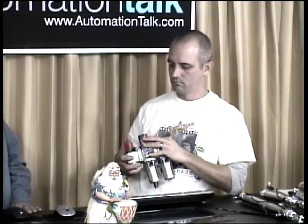Right. And then also, practice lockout, tagout. And then one step further, even if you shut off the main valve and lock it out and take pressure off the system, there's always going to be some accumulation of pressure in some cylinder or something. Make sure you take a hard look at the equipment and bleed that pressure off.